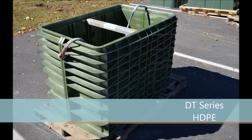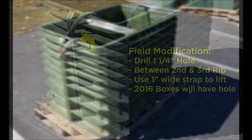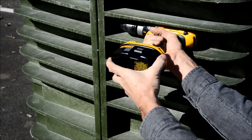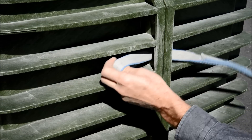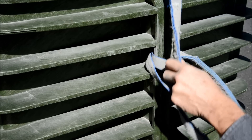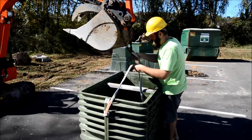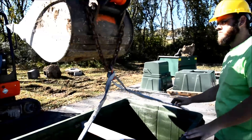Hubbell's PenCell HDPE enclosures will have different lifting points than the Quasite polymer concrete enclosures or fiberglass reinforced polymer enclosures. In 2016, Hubbell's PenCell DT series enclosures that are 24 inches by 36 inches and larger will include two lifting holes. Older DT enclosures can be quickly modified in the field to create two lift points. Between the second and third rib on the side wall of the box, drill a one and one-quarter inch horizontal hole as shown. Clear any plastic debris from the hole. Use a one-inch wide lifting strap designed to carry the load, and insert one end through the hole while pulling one end through the eye of the strap. Secure both one-inch straps onto the lifting device — in this example, a D-link attached to a chain on the bucket of a small track hoe.